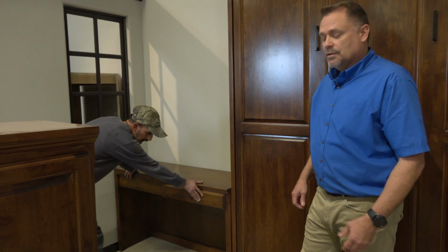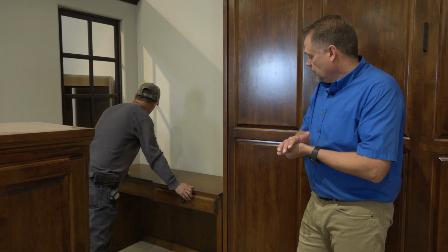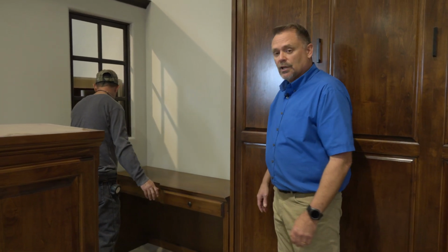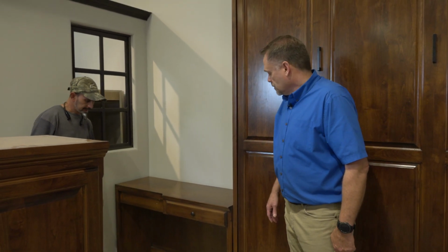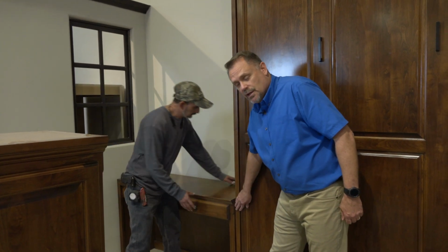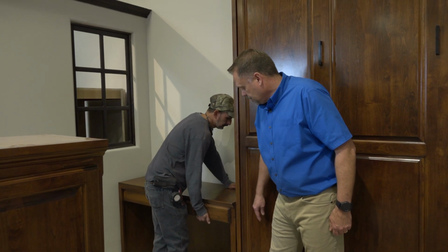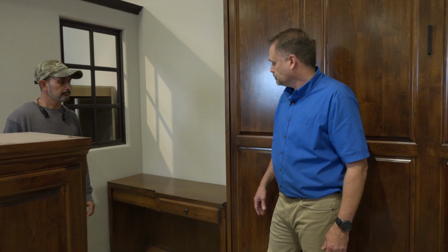Now the side pieces can either sit freely on the sides or you can attach them. If you're going to attach them, you will want to use some of the enclosed hardware, the dark drywall screws, and screw from the inside into the side of the case. That will secure the desk into place. You won't necessarily have to do this unless you have very thick carpet and things don't sit evenly. If you have hardwood or tile flooring, you may not have to do this process at all.